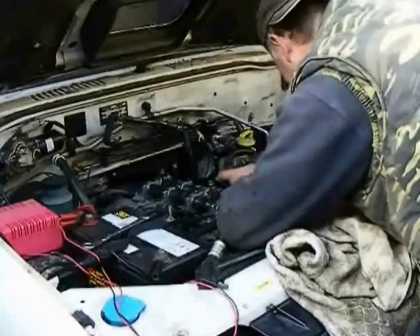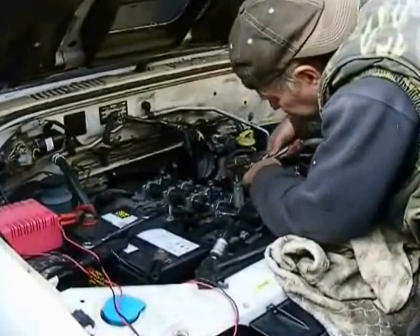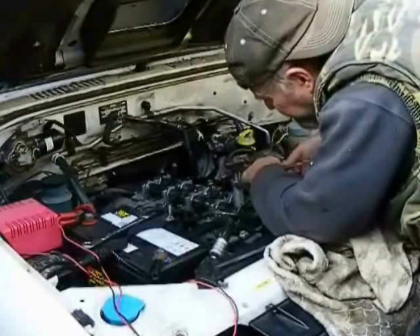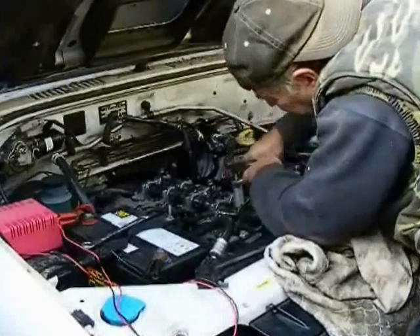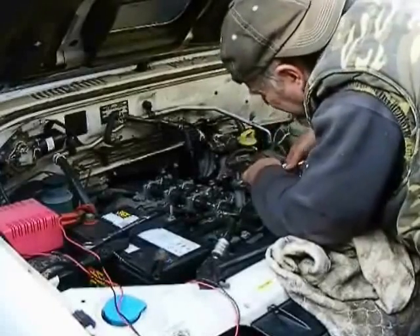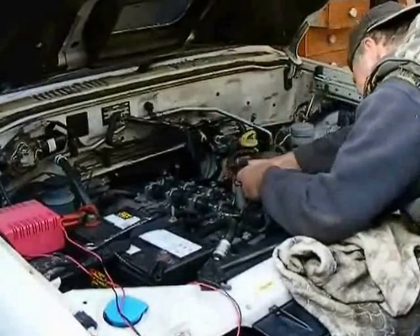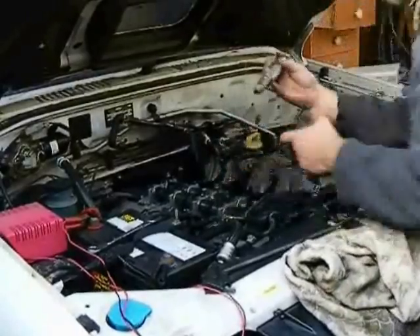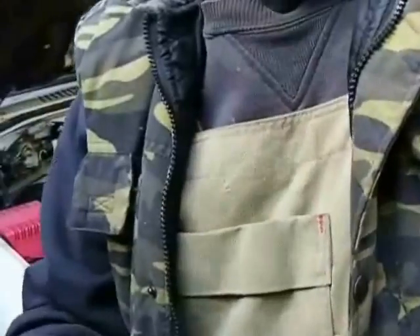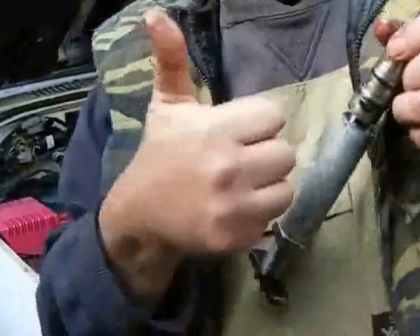I kept on waiting for it to ease out, but it was tight pretty well all the way up. But then it started to go loose — the moment of anticipation, waiting for what's happened down here. And there it is. There's the sleeve extracted — see it's on the end of the tool there, the two O-rings, you can see it quite clearly, and there's the locking dogs in the holes. It came out cleanly — that's success. All we're going to do is the other three now.